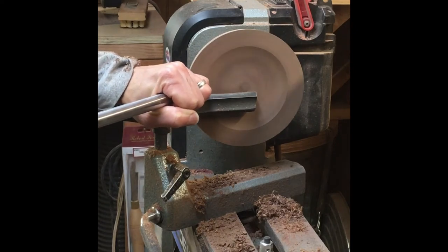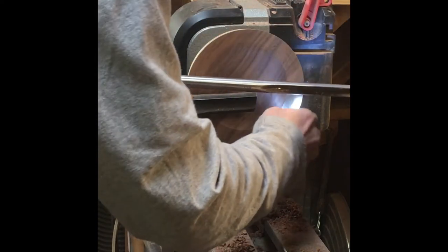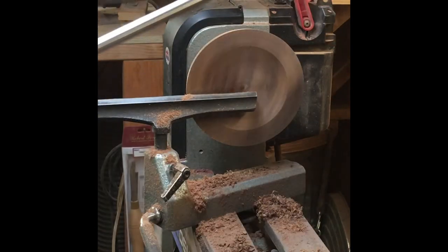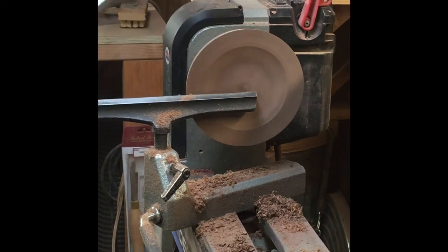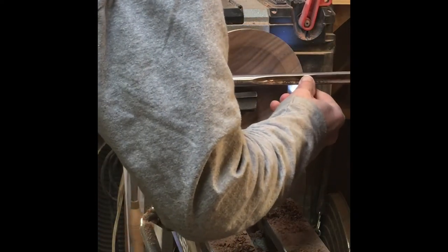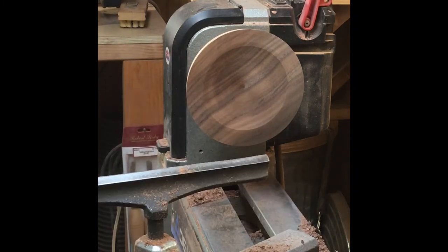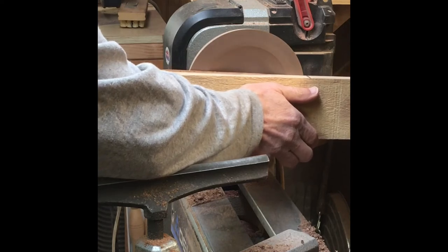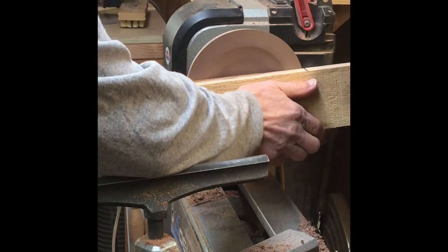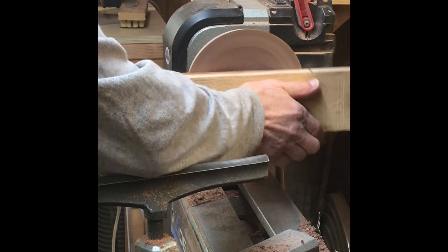I then will flatten the receiving edge. Here I have the base piece on the lathe and I like to use my bowl gouge to flatten the edge. I'll put the gouge across it with a flashlight behind it to see if it's perfectly flat. Once you're happy with it, it's ready for the sanding board — it really doesn't need more than 5 or 10 seconds with the board as long as you have it nice and flat from your bowl gouge.